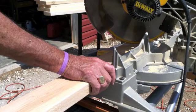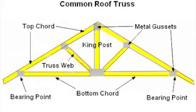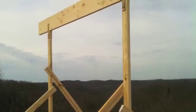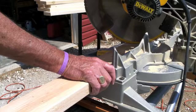There really are two types of truss building, or two types of roof support when it comes to tiny house construction. The first is a standard truss assembly, which means creating a triangular shape out of two-by-fours that supports the weight and integrity of your roof. The second is to run a ridge board from front to back of your tiny house and then connect your ceiling joists to that ridge board. Also a fine idea.